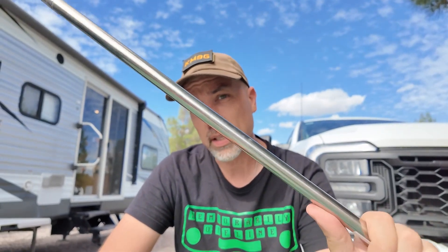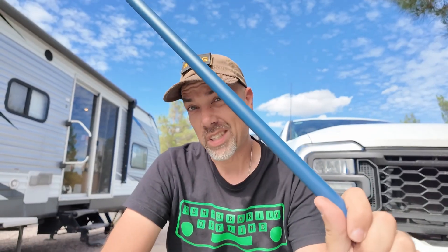They were a lot closer than I thought they would be. I'd like to hear from you in the comments what your thoughts are between the carbon fiber and the stainless steel. In a previous video I showed the tune-up charts, the length, the weights, and made contacts with both — so I know they both work. I've been using the 17-foot stainless steel whip for years; it's my go-to because it's quick and easy to deploy. Both collapse to about the same length, though the carbon fiber one is slightly longer but lighter. The stainless steel has the benefit of being tunable by shrinking the whip, which you can't do with the carbon fiber. I'll leave links in the description for the Nano VNA, the case, and both antennas. Thanks for being awesome — I'll see you over there.